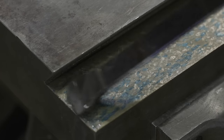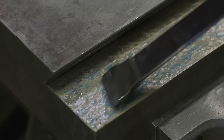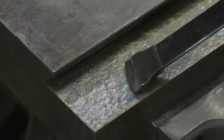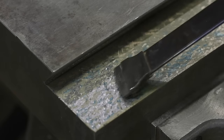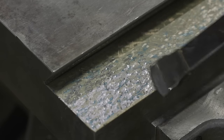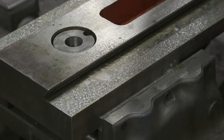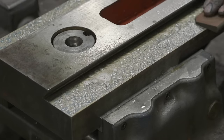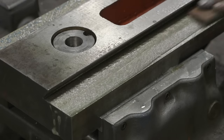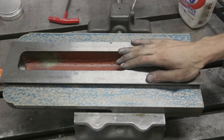Flipping over to the other side, we're just cleaning up some of these spots. We have a really short stroke length, trying to only hit the blue and leave the yellow highlighter remaining. You really get down to the end where it gets satisfying when you have that really nice fine-grain surface finish texture. We'll come in for the last time, hit this with some 409, knock the burrs down, and do a very last and final print on the flat surfaces. After about 40 different prints, here's where we're finishing out and I'm very happy with the result.